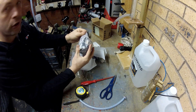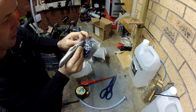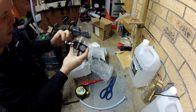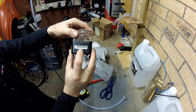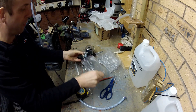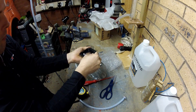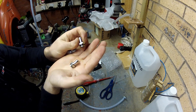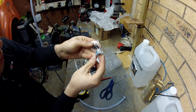Right, so here are the pumps — Sys Cooling SC30s, still sealed as you can see. Here we go. SC30A, made 19th of October 2013. You get some accessories with it as well. We've got the vibration mount, which is a combined foam pad and rubber mount — that's just to stop vibration going through your computer. We've also got two quarter-to-three-eighths hose tails, or barbs, the three-eighths clamps, and some screws for mounting the vibration mount.